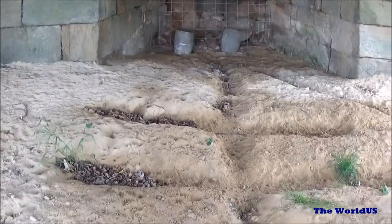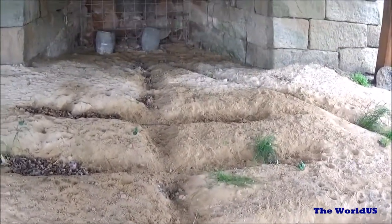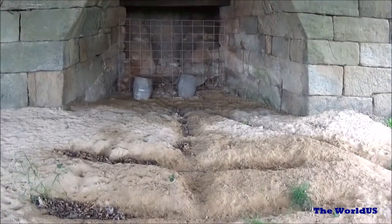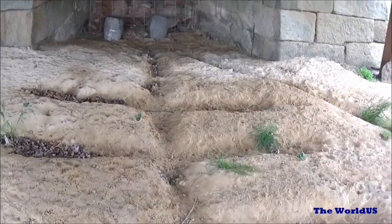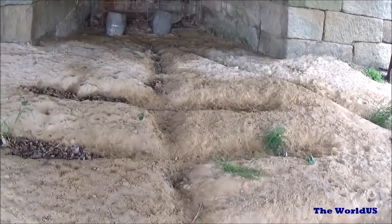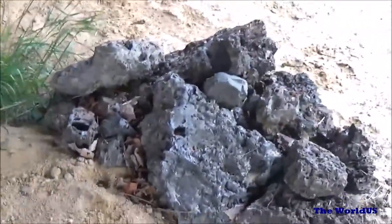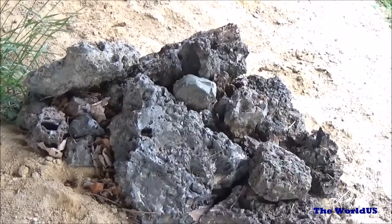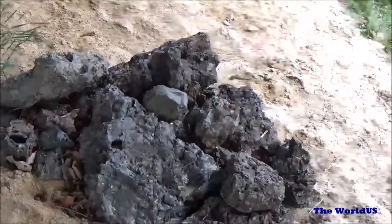What we see here is a trough — this is actually what they named the ingots for. They called them pigs because this looked like piglets suckling on the mother pig. The molten cast-iron would come out and fill up each one of these, and after it cooled they would break them off, put them on a trailer, and ship them into Pittsburgh for processing. Cast-iron is very high in carbon and can't really be used for anything without changing it into wrought iron. Here's some of the slag that's left over as byproduct — the slag would come out first, and after that you'd get the cast-iron.